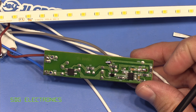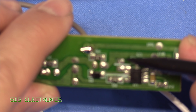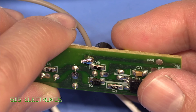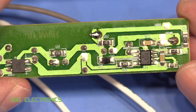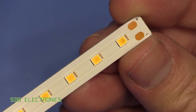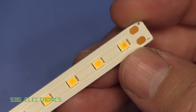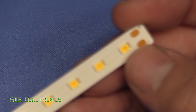I can't actually see anything wrong with the PCB. I've had a close look and visually everything looks fine. Apart from — I can just about see here — it does look like that trace has delaminated slightly onto this inductor. And if you give it a wiggle, you can see that, but it has got continuity to that track. The only other thing that caught my eye is — I did say I didn't see any damage to any of these LEDs, but I just noticed this very end one on the strip looks a little bit darker than the rest. All the other ones look fairly similar, and then this one has got a dark spot. So maybe we'll just get the multimeter out and test that one.